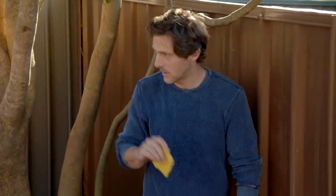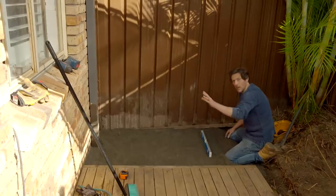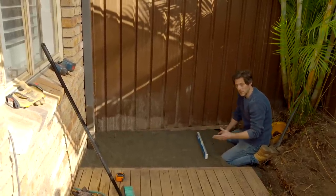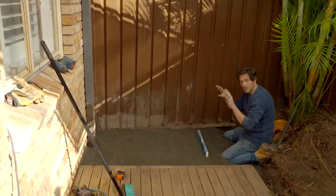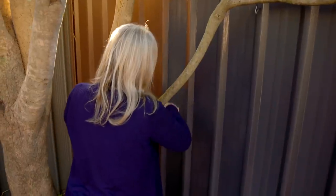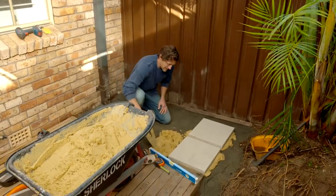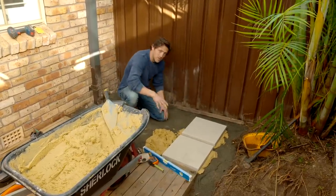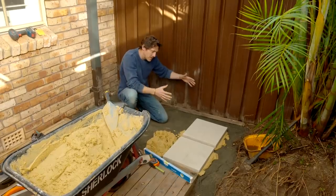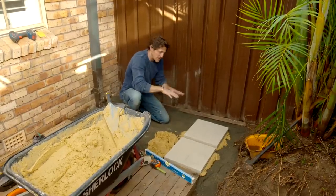The sanding is finished, so I'm going to leave you to paint. I'm going to get on with some paving. For the area off the kitchen, we're going to be putting in a barbecue, and for that we need a nice solid base, so I'm putting down some paving. The base is crusher dust with cement mixed through it — we compact that down. I'm laying my paving on a wet mix so these pavers aren't going to go anywhere. I'm leaving a bit of a gap for some pebbles, because adding textural interest to the edge of the garden draws the eye out and makes it feel bigger. Another trick is a light-coloured paver — this bounces light around but isn't on the vertical surface, so it doesn't bounce in your eyes and feel uncomfortable.